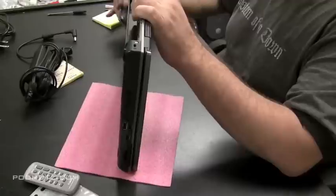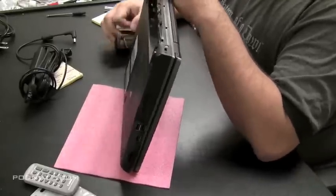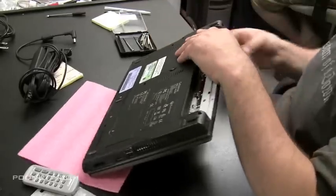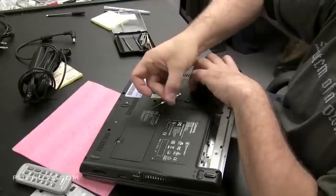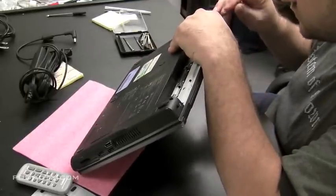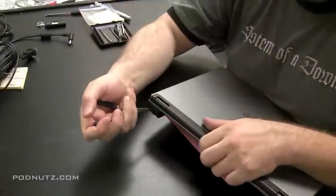And that's if the jack is okay. Once I pull this plastic out, we might find that the jack is not okay and we have to replace the jack. But first things first, I'm just using a tiny set of screwdrivers. I think I got it for $1 at Micro Center. I just picked the tiniest one there. And I'm going to use that and try to pry out the plastic that's stuck in the power jack.